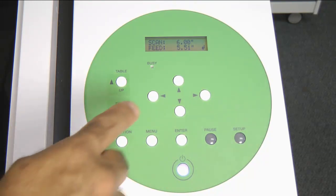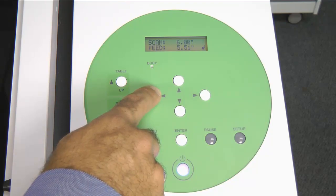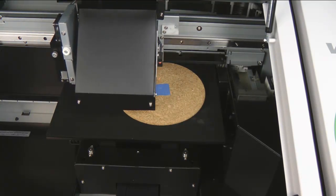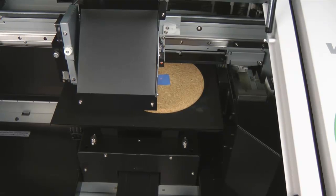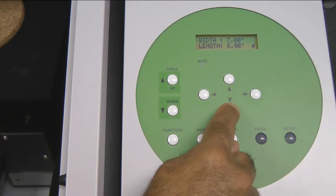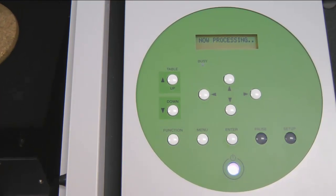To move the carriage out and set our center point registration, press the left arrow key. The laser pointer, located on the right side of the carriage, will turn on. Using the arrow keys on the control panel, move the laser pointer to the marked-off center position. Once we find the position, press the Enter key to set that value as our center point registration. Using the left and right arrow keys, set the width of the item; using the up and down keys, set the length. Once set, press the Enter key. Now we are ready to output our file using Roland VersaWorks.